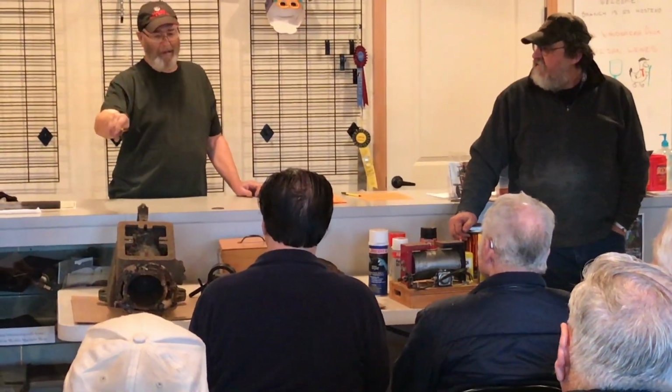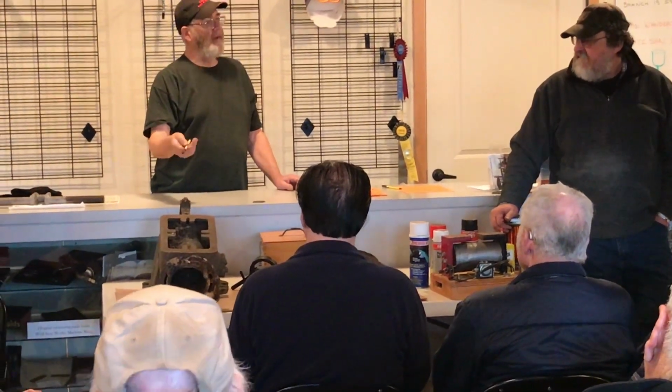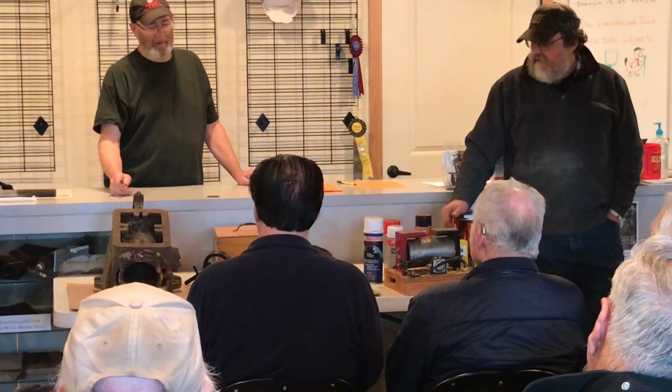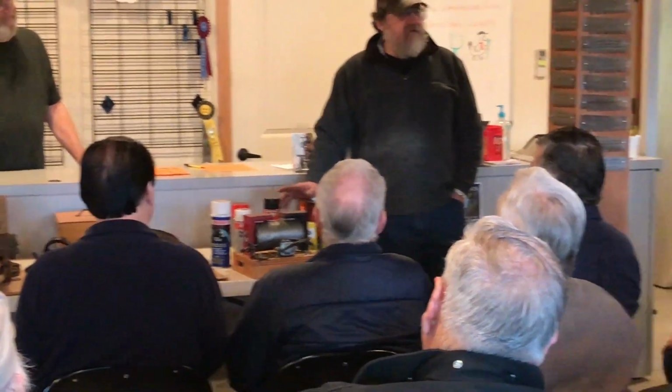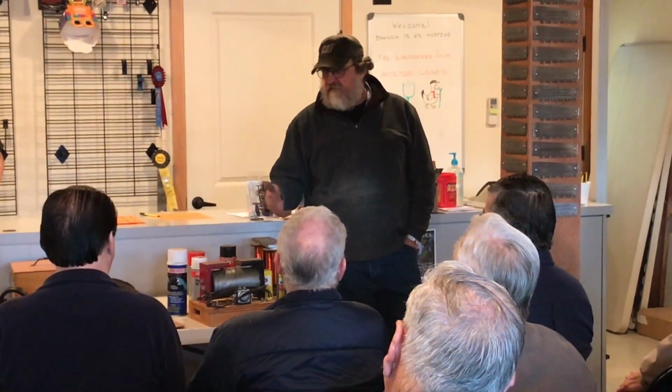Because it was hot out here and he cooled that piston completely off in a hurry. That broke the rust adhesion, if you will, and he got it out that way. I've read articles where guys have taken Zerk fittings and sealed the valve, made sure the valves were closed, and pumped it full of grease to blow out a piston, but then once the piston blows out, you've got a mess.